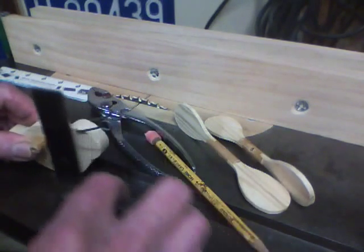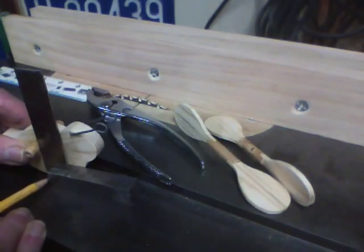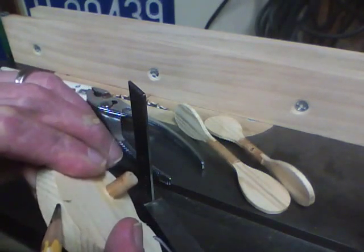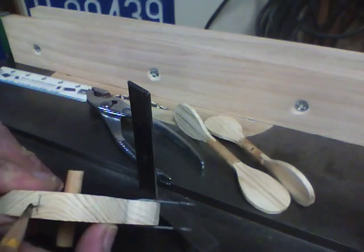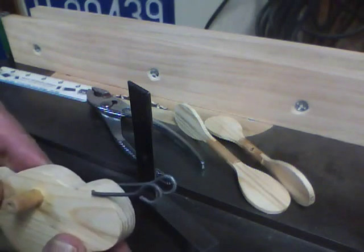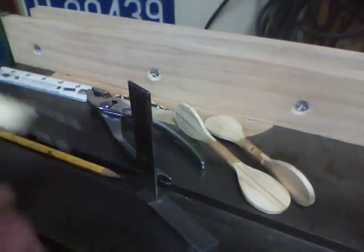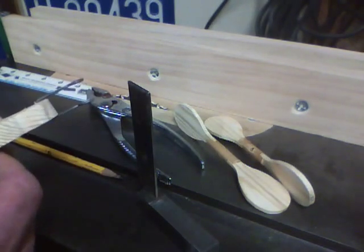Select what position you want it to set at, and mark a little line on the bottom. Transfer it over, then we'll drill a small hole in the bottom - probably around three thirty seconds, or whatever you have handy, eighth inch, maybe even three sixteenths.